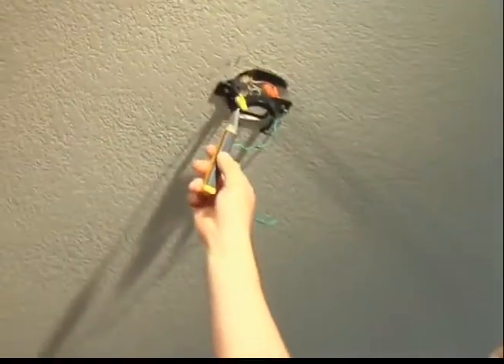Take a moment to identify the wiring in your home. Most homes will have a standard black hot wire, white neutral, and green or bare copper ground wire. If you are unsure as to which wire is which, we strongly recommend using a voltage tester or consulting a qualified electrician. If you have two switches at your wall that control the ceiling location, you may have an additional black or red wire. This additional wire will be discussed later in the video.